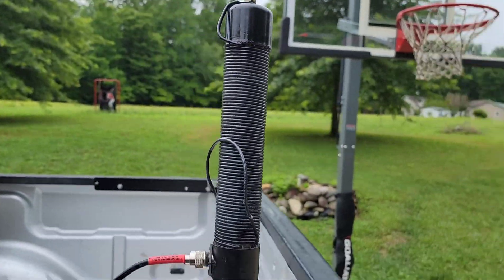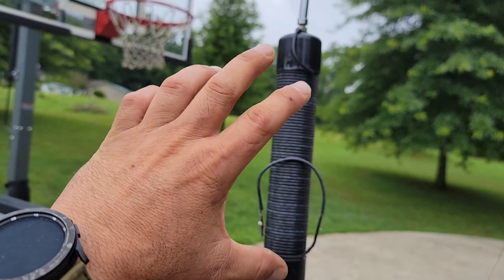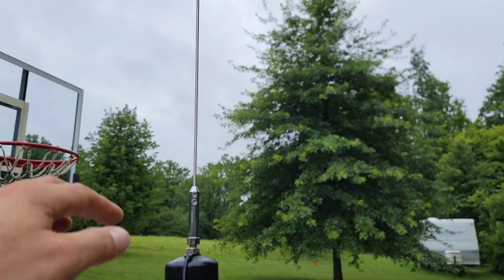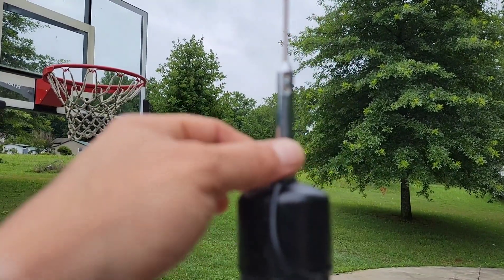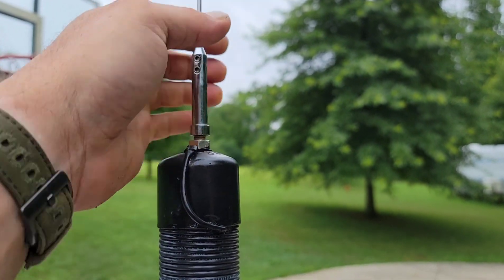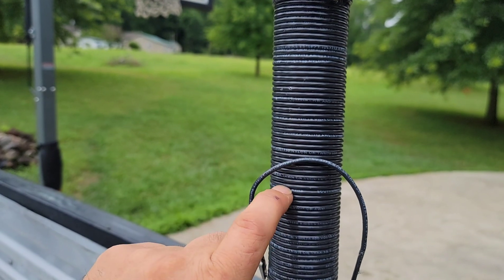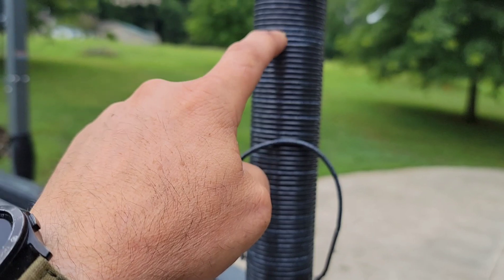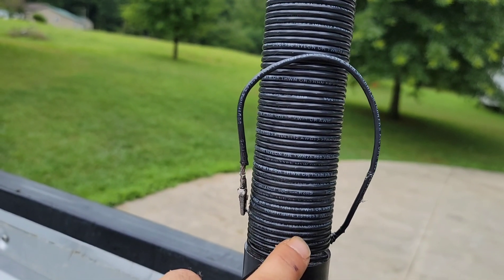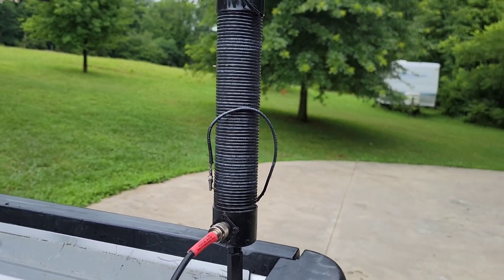It's an inch and a quarter PVC pipe with inch and a quarter caps. The whip is 52 to 53 inches long — that's an old CB antenna that Roger gave me that he'd cut down to 10 meters. I bought the bolt that attaches to it — it was a 5/16-24, so it took me a minute to find that. It just screws right on and comes on and off. The coil — I don't have a measurement. What I did was the first one I made wasn't long enough to get 40 meters. So I did six turns per inch on this, and to end up getting 40, which is where the pin is right here, it ended up being 62 turns around that. I had a 500-foot roller and just started turning.